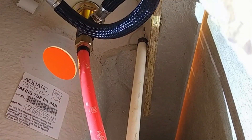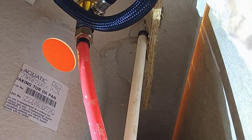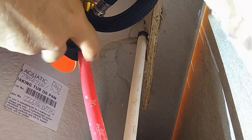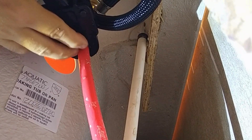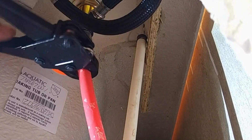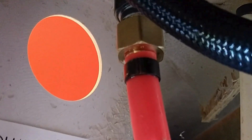I'm going to put that back down. Hopefully you can see what's going on — we're going to make a crimp. You can see some of the water coming up. To crimp it, this tool slides up over. Make sure you have full connection and squeeze. There you see it up close — you just get it wrapped around there, squeeze, open it back up, pull that off. And there it is — that is how easy it is to replace a connection.